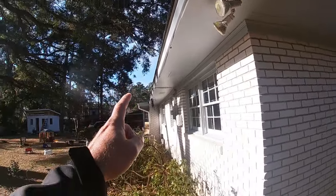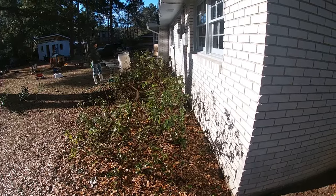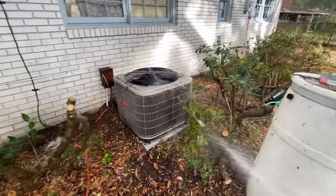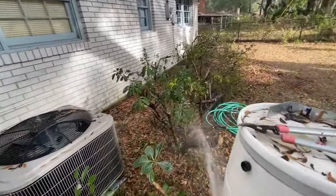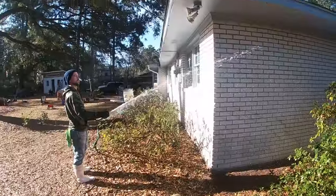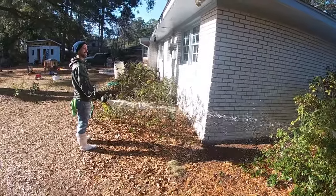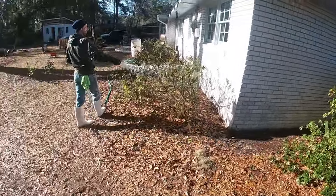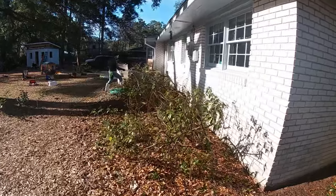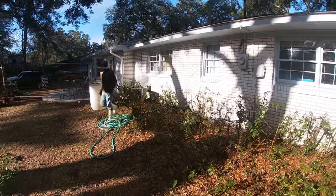You monitor where the roof line is in relationship to the plants, and you make sure that you're watering everything unbelievably thoroughly throughout the entire process. The solution by the time it hits the ground is almost non-caustic, but the watering of the plants is so essential. Cody at Southeast Softwash — I heard him say the solution to the pollution is dilution, and he was 100% spot on. That is what we're doing right now, diluting our roof wash mix to the point of not having any impact on anything down below.